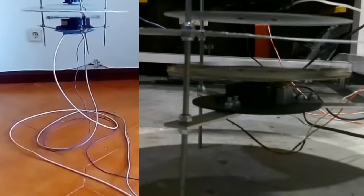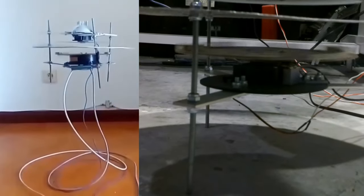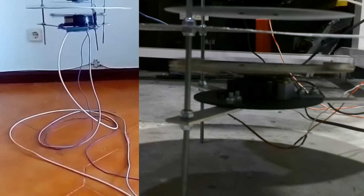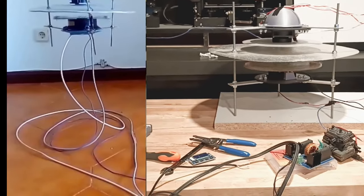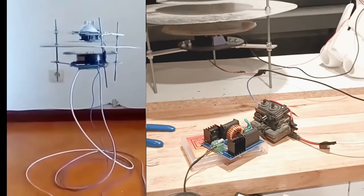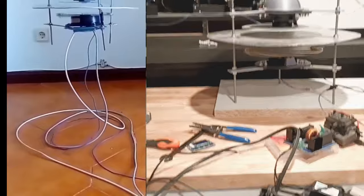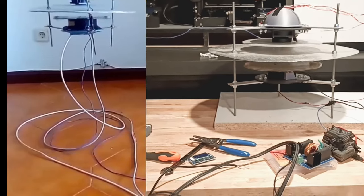We have Alexis's gravity flyer on the left and mine on the right. We're just looking at the bottom disc, checking motor speed to see if we got it correct. We're almost dead on. Our motor is running at 11.5 volts on a 12-volt motor. Looking at this again with a different video on the right, we are just about equivalent to Alexis's gravity flyer. I have it tuned down just a little bit to 11.1 volts compared to 11.5 before. We are really, really close to that speed - I think it's just about perfect.